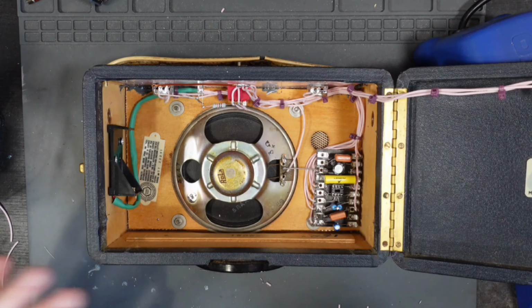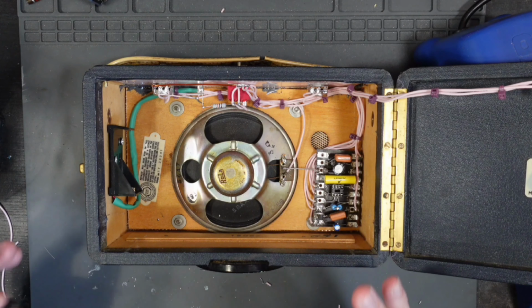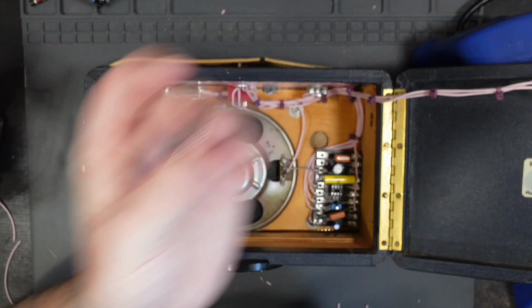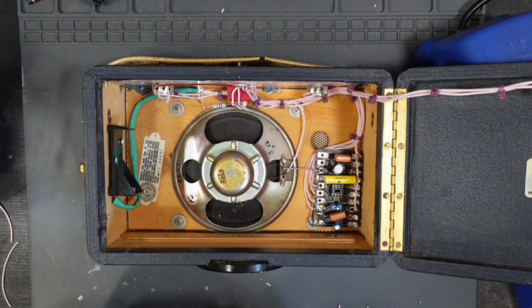Here's another valuable lesson. I have actually now cable tied everything in and went to do a sound test, and of course nothing worked because of this. I hadn't actually fitted the Opamp. I say it every single time, I always forget something like this. So I'm going to go ahead now, fit the Opamp into our socket, and then we'll move on.